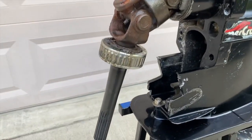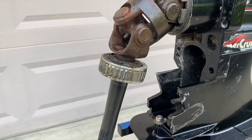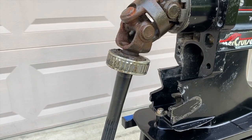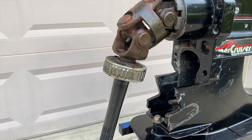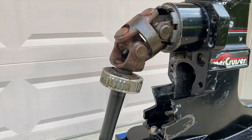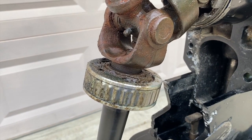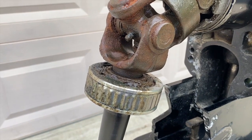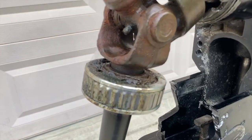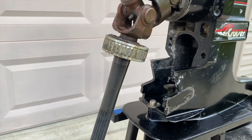What a lot of people will ask in the event that you inquire about a gimbal bearing seized or stuck to the shaft is: how long has your boat been sitting? In our case, unfortunately, it has been sitting with absolutely zero movement for seven years. You would think it shouldn't rust or seize because it's properly greased, however it happens, DIYers. Corrosion and rust can get in there even with the grease and seize it in place. Those are the three common causes.